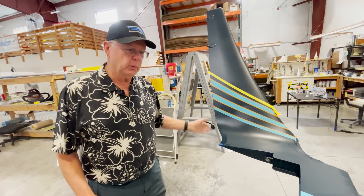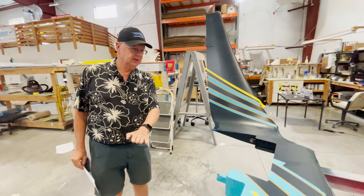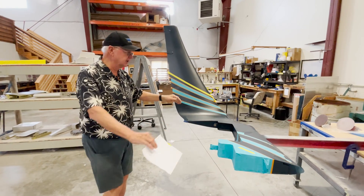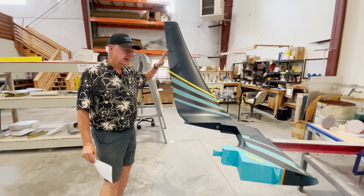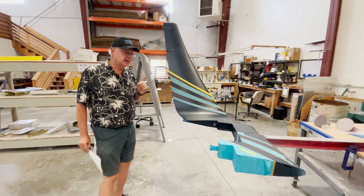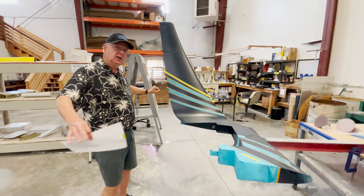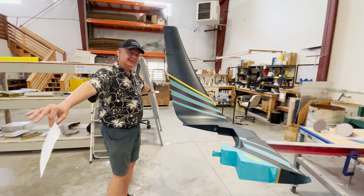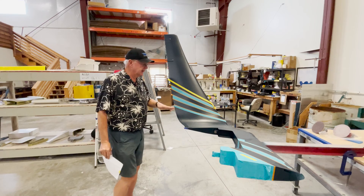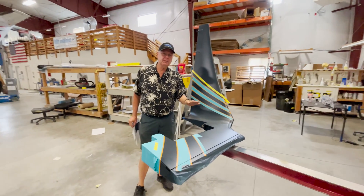This is quite different than a typical winglet. Other winglets before Tamarack came up with this design were passive winglets — the winglets are in a continuous piece, an extension of the wing, and then come up to the winglet itself. So you have the wing extension and then the winglet. The whole purpose of the winglet is to give you better lift. It does that by a couple of processes: one, it actually changes the aspect ratio of the wing, just as if instead of the winglet bent up, you had the wings flat. That's one of the advantages of a winglet.